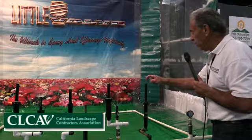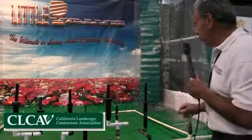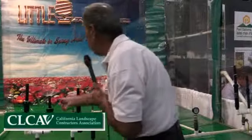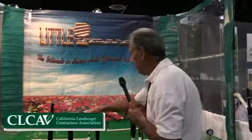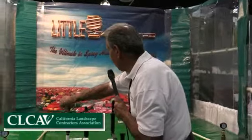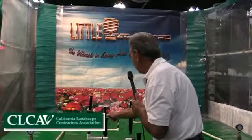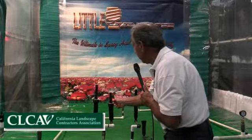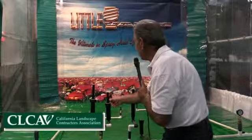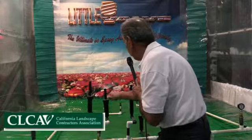You'll also never touch the screw on top. For spray nozzles, all you need is 15-foot nozzles, and the reason we're on the rebate list is because the 15-foot nozzle puts out droplets that are bigger, fatter, and heavier than the smaller ones. You'll notice there's hardly any misting — I've got this on about 15 feet. This is your 15-foot nozzle; this happens to be a Rainbird nozzle.